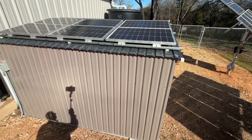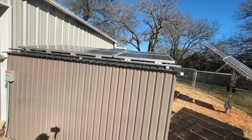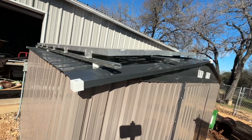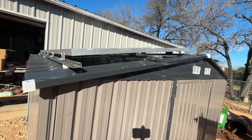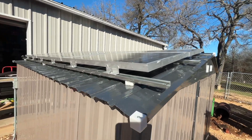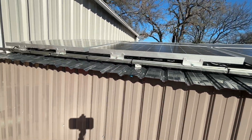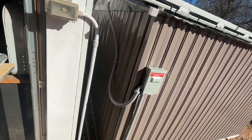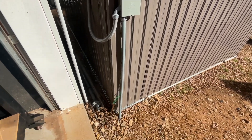What I've done: I've mounted six 100-watt panels on the roof of my little metal storage building. What I used was this unistrut — three 10-foot pieces — and I used the unistrut nuts and the solar panel mounting brackets, and ran all the wires up under there and tied them into my disconnect box, then went underground.